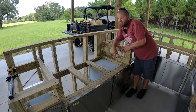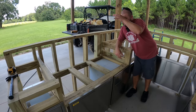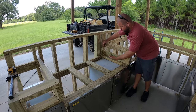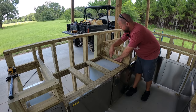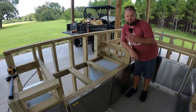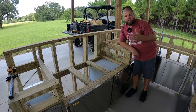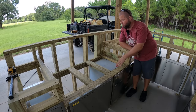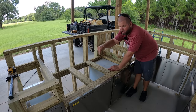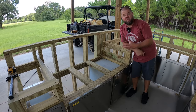I've got everything done — I made a couple of mistakes, put the studs on the wrong side, but instead of ripping everything out I scabbed some corner bracing in, so that's why some of this looks a little odd. Oh well, it's just a little more overbuilt now. What's critical is that everywhere you have a corner — because I'm laying sheathing in three-quarter-inch plywood that's going to meet in all these sections, which I'm going to tile to — I like to have full wooden support there to screw in my edges, because the edge is going to be the weakest part of plywood. I've worked extra hard to make sure I can screw into at least a stud vertically and then have lips horizontally to screw down into.